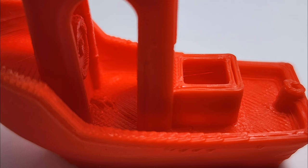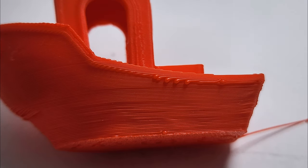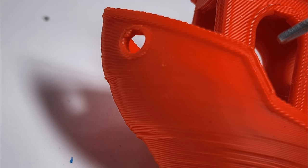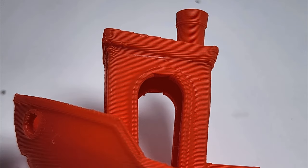As you can see, there's a bit of over extrusion or bulging. It's over extruding tremendously. There's zits, there's bubbles, it's not smooth. It even looks like it's shifted. So clearly this Ankermake is not meant to do 500 mm/s. I don't know why they enabled an experimental setting when clearly it can't even do the built-in Benchy test properly without the print looking like complete crap, basically.